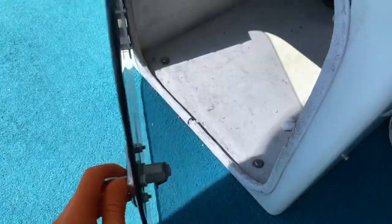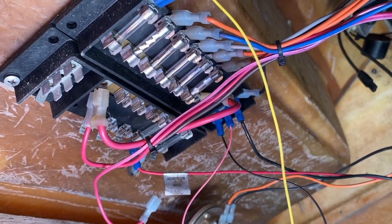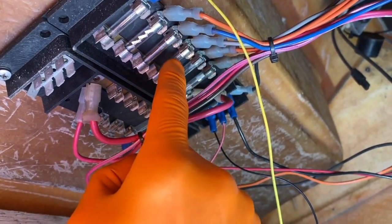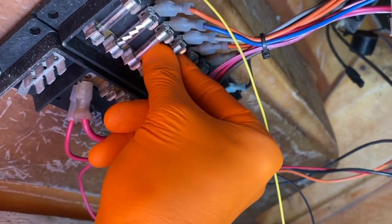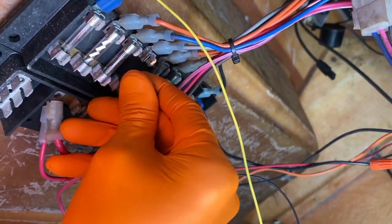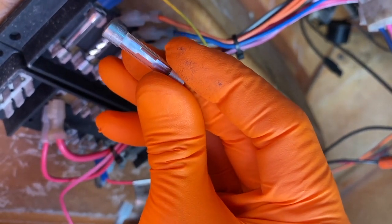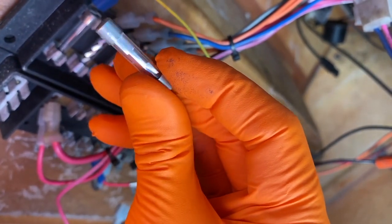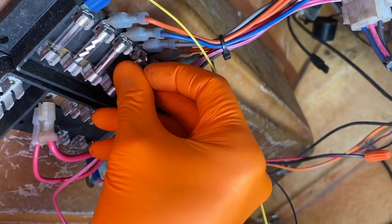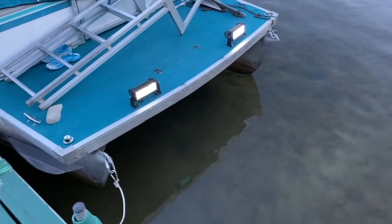Back on the boat — check your fuses. In our case, ours are up under there. Here are all the electrical wires, and there's that gray wire that feeds into this fuse right here. I want to carefully pull it out — and that's what it looks like. If yours is blown or badly burnt, go get a new one and reinsert it, securing it into its pressure fittings.